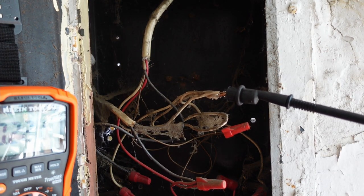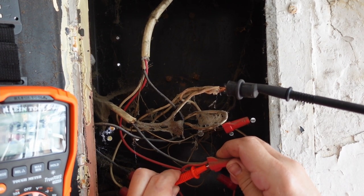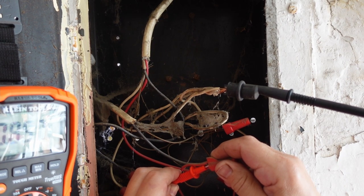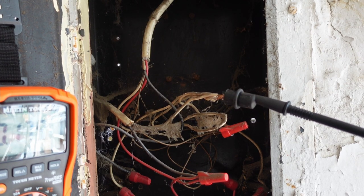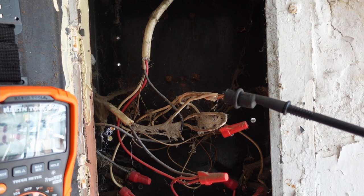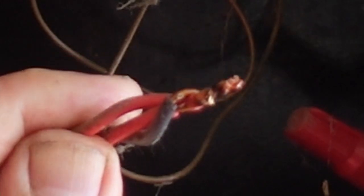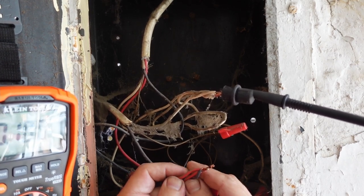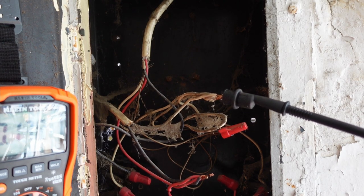Got this one on here — checking to make sure that there is voltage there. Oh, look at that — it comes around. That's interesting. When I put the test lead in, the light comes on; when I pull it out the light goes off. You can see that one wire is not making very good contact. Okay, at least I found where I think the problem is. Now let's try and figure out how to fix it.